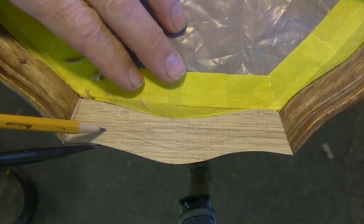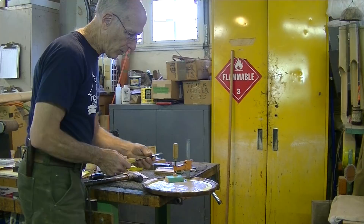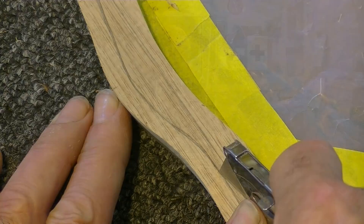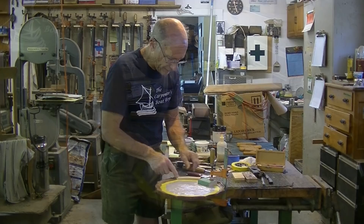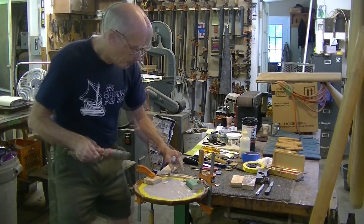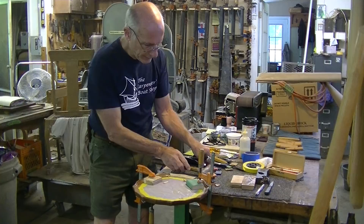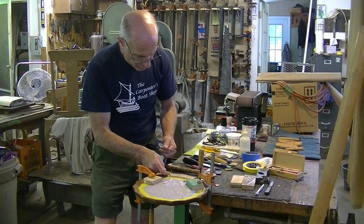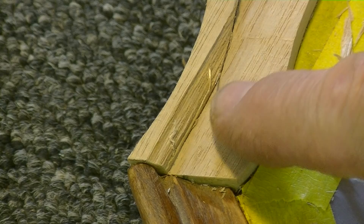And then I've just got to start removing a lot of wood. This is my widest gouge carving tool, but it's not quite right to curve. I think I'll need to cut my line with a knife first. I've scored this as deep as I can right now with this knife. I think I'll remove a bunch of wood as much as I can with a chisel up to that line. I'm just going to keep chiseling this down to my line, chiseling and cutting as I go until I get it to this level — the inside edge of this curved outer molding. I've got this initial part leveled down to that little ridge. It didn't take long, about 15 minutes.